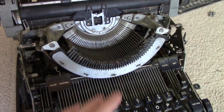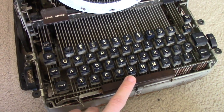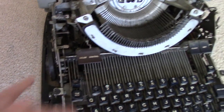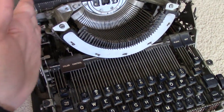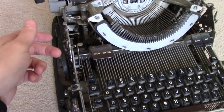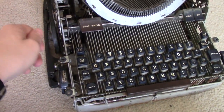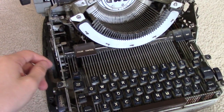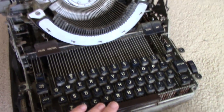I know the carriage can move left because when I press tab the carriage moves under power - but it doesn't do the single character advancement. Just last night I discovered what's going on with that. The space bar actually activates one of the metal dogs down here that attaches to the rubber roller, which imparts energy to a lever that causes the carriage to advance. The pivot that lever is on is very hard to move - I can move it manually with a screwdriver and the carriage advances, but the spring isn't strong enough to move it on its own.